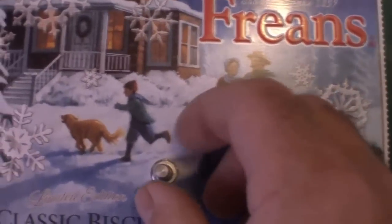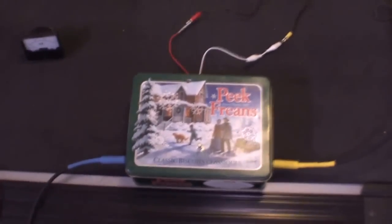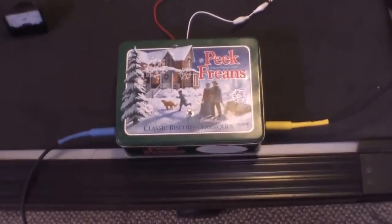So I got her boxed up. This is the input and the output. One gain knob here and then my power wire is going in the back. It's not as quiet as I'd hoped for, so I'm going to work on some of the wiring inside, making it shielded, to try to get it to be a little quieter.